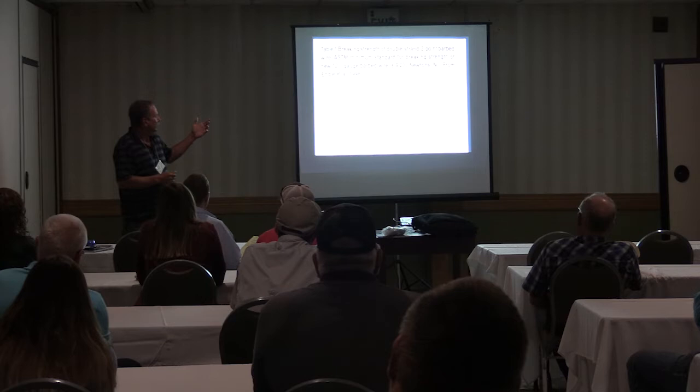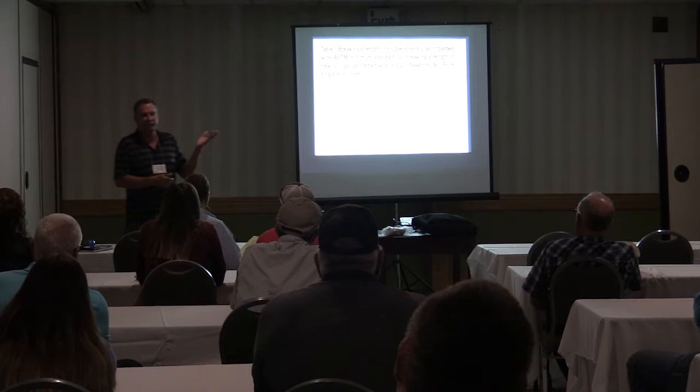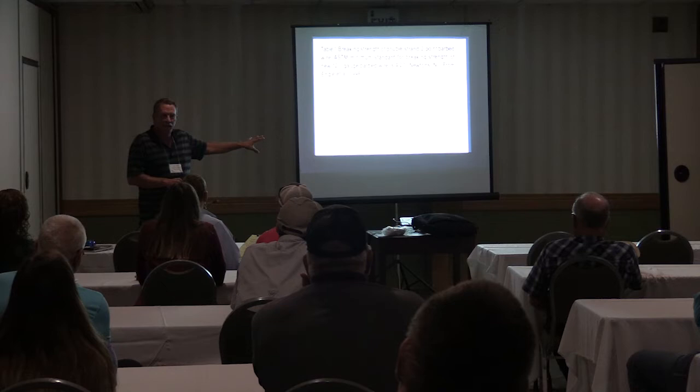We left the other 12-inch sample to do our zinc testing, to see how much zinc coating was left on it. The standard was 4,230 newtons of energy. Every one of the wires we tested were well above industry standards. None of them had ever lost any. So the heat, the fire, anything that impacted the fire had never touched the tensile strength — even through six fires — no problem. This is all fence with galvanized wire on it, newer fence. This fence was put in in 1982, and the study was done in 1997, so that fence was 15 years old.